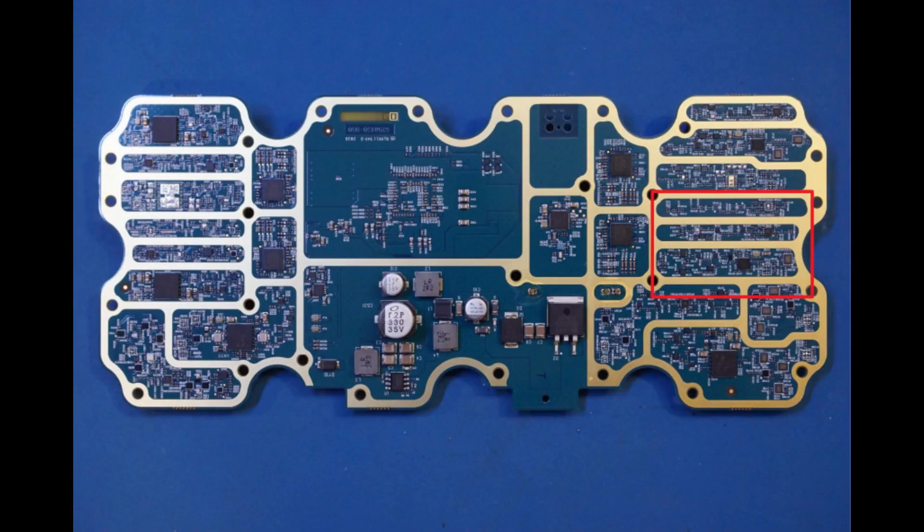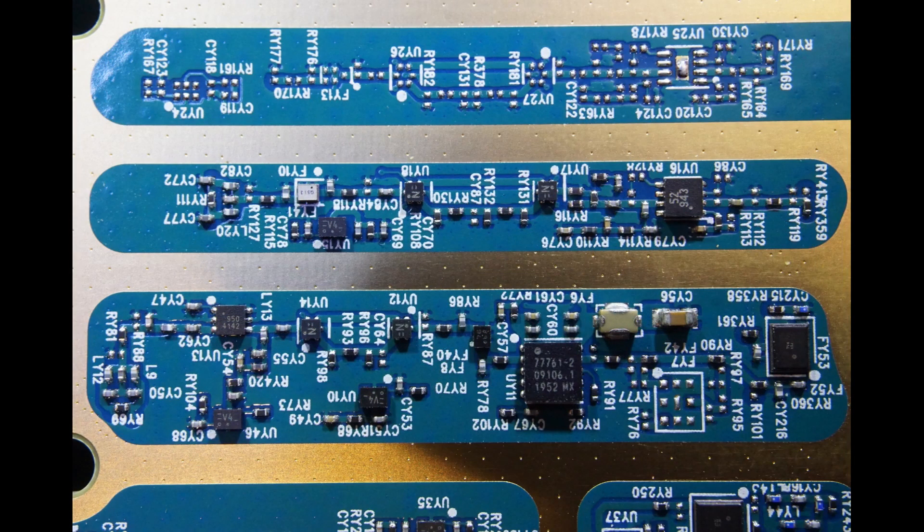Here is another section on the cell phone communication side, towards the middle on the right. You can see how similar it is to the section we just saw. I think this is because the model we have here operates on two distinct frequency bands — one is at around 800 MHz and the other is at around 2 GHz. Within each frequency range we actually have multiple cell phone bands; for instance, bands 2 and 4 are roughly in the 2 GHz range, and cellular bands 5, 12, and 13 are between 700 to 900 MHz.